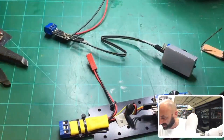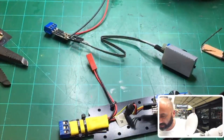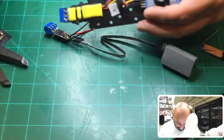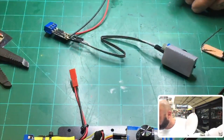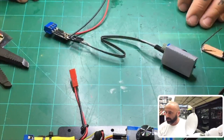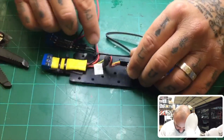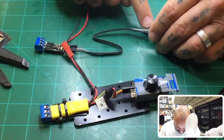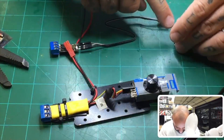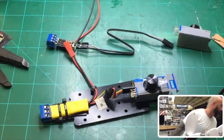I realized what I pulled was the 12-volt regulator and not the 5-volt, and I don't see a 5-volt around. The 5-volt is on my existing built unit right here. So what I'm going to do is feed this with 5 volts and show you guys how it would work. The 5-volt regulator would go between the JST battery input and the servo tester.